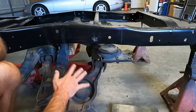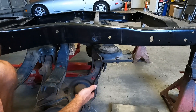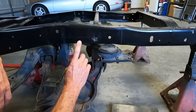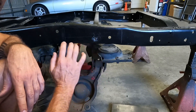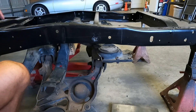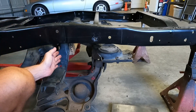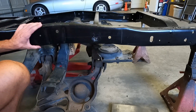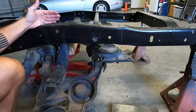So anyway, I went ahead and stripped down the rear subframe assembly quite a bit so we can use the jack to raise it up and sort of do fitment. Now the first thing I did was go over to the truck bed and find the center line of the opening in the rear wheel well based on the mounting bolts to where it mounts the frame. That allows me to know where I want to find center on this rear suspension position, because nothing else really matters except for when the truck bed is on there — are your back wheels centered in the opening.